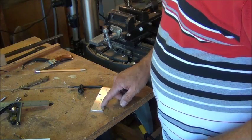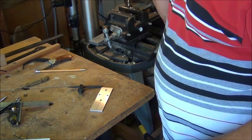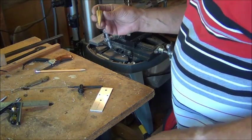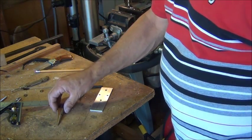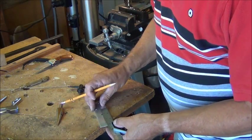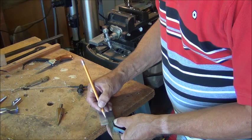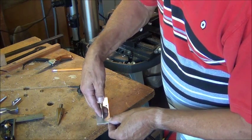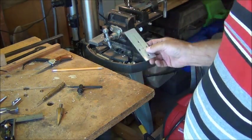The next hole is going to be for the SO239 connector, and I'm going to use a stepped drill bit for that. I'm going to use the drill that's already in the drill press for a pilot hole. It was 3/4 of an inch in from the edge, and I already had that center line drawn down the center of the piece of metal, so all I have to do is mark off 3/4 inch, use the center punch to mark the hole, and go ahead and drill it.